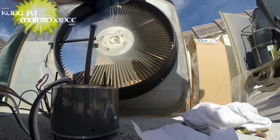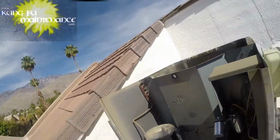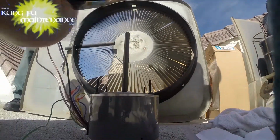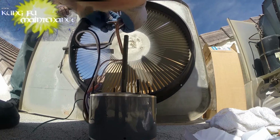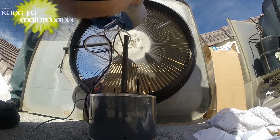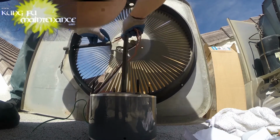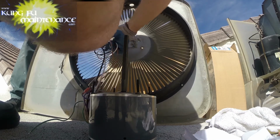So I'm actually going to take this grommet and go ahead and stick it in here. What it's supposed to do is help keep the wiring from rubbing on the inner lip. Okay. So in order to feed the conduit through, I usually just kind of angle these and then stagger these two a little bit to make feeding them through a little easier in theory, and then use the other wires to help push them through. So a little stagger, and then a little push. Usually that works for me.